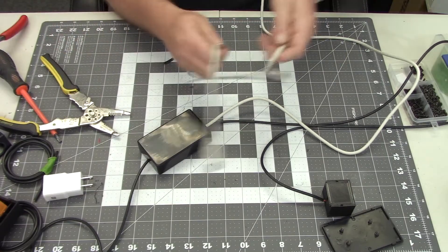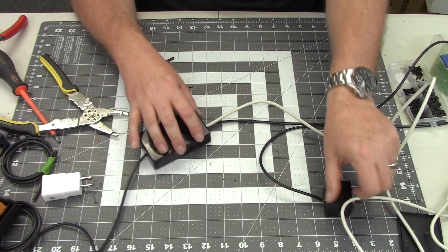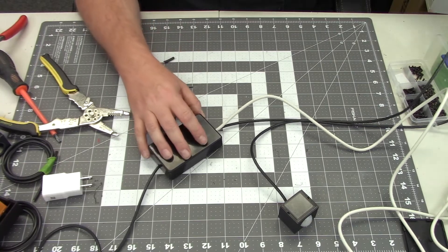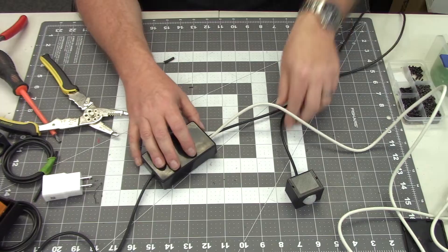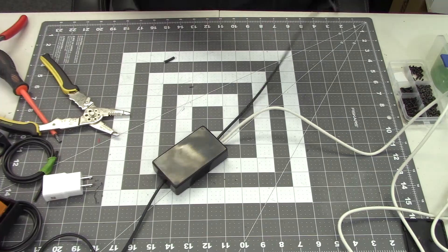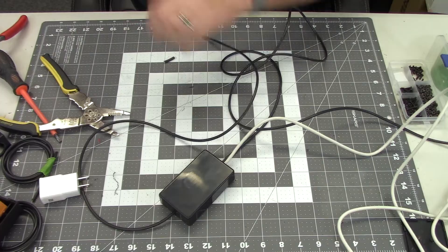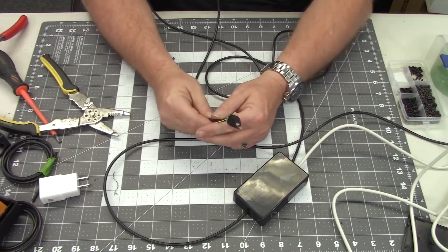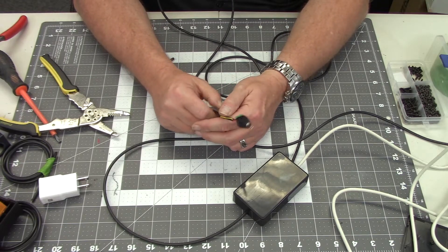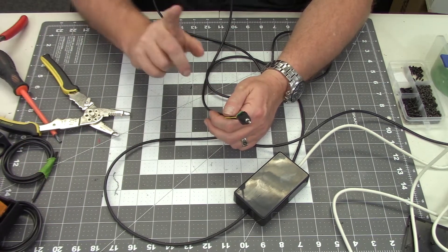Here's what we have so far: the white power cable goes to the wall wart or power pack — remember, only five volts, you don't want anything more than that. The black cable goes out to the motion sensor. And on the other end of the box is what's going to activate the switch — right now a one-eighth mono plug that goes into a trigger port. Let me set up a demo to show you how this triggers.